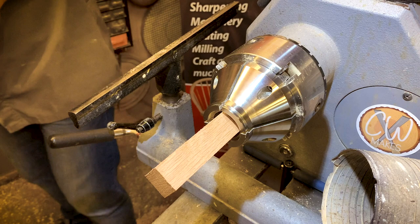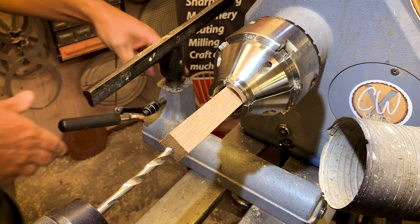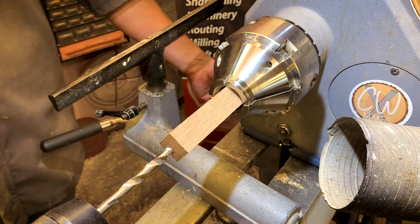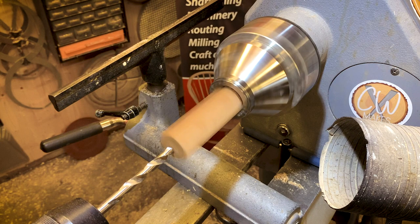All of these, or both of these projects, the actual metal piece, the stopper and the opener, I actually epoxy them in. So I use a 30-minute epoxy resin, Z-poxy in my case, and just drill that in.